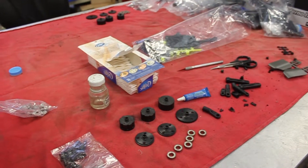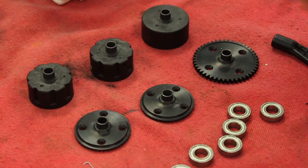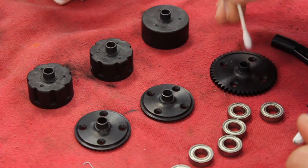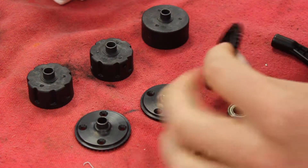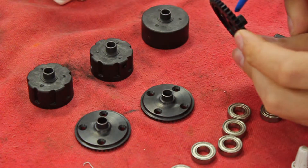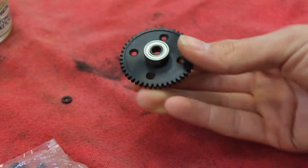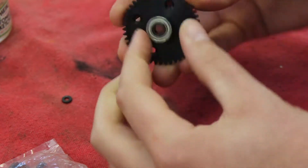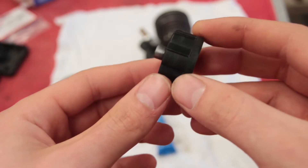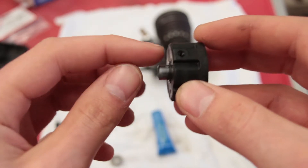Next thing is, it's kind of important to glue the bearings. All you do is get some green Loctite and clean the surface with some nitro cleaner, lacquer thinner, or brake clean — some sort of solvent. Put a little tiny bit of green Loctite, and also clean the inside of the bearing races. You can see here now the bearing is glued on, so you can't pull it off. That's what you want to see.